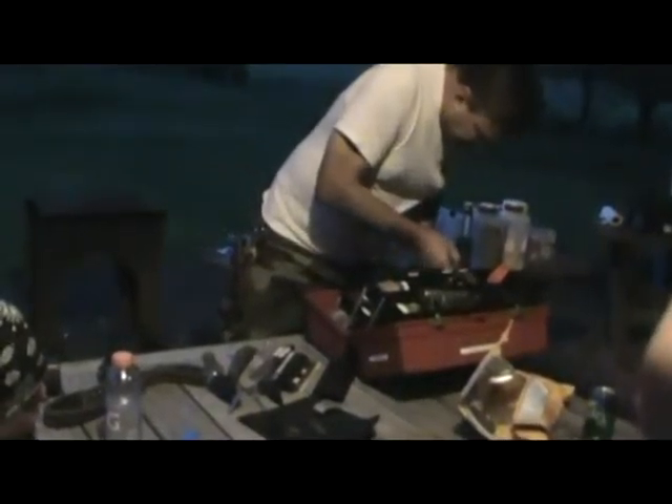The most important thing is to take the burr off. Whenever you sharpen a knife, you'll have a little piece of metal that curves over the edge. Take the burr off. You don't really need a special tool — you can use your belt, a piece of leather. Any time you sharpen freehand, you've got to take the burr. People will sharpen and say, 'Tom, I did everything you said, my knife's not sharp.' I take the deburring rod — oh, they forgot that step. So you need that.